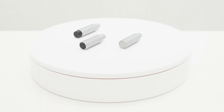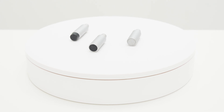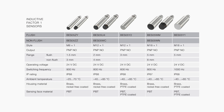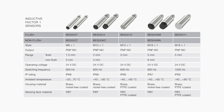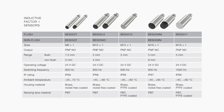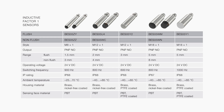The barrel style sensors are especially well suited for these environments, with brass housings that either have a nickel-free coating or a PTFE coating. Some also offer a PTFE coated sensing face for added protection. This, combined with their extended temperature range from minus 40 degrees C to 85 degrees C depending on the sensor, ensures fault-free sensing even in tough environments.